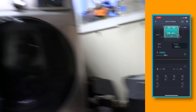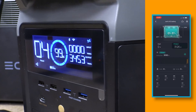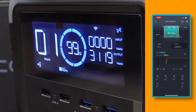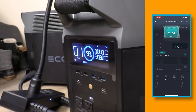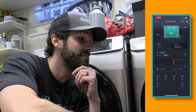How about an electric dryer? Boom — 800 watts, then it kicked into high gear: 3,000 running watts on both batteries. The heat element is cooking in that dryer. The fans have kicked to a higher speed. We're down to one hour of run time. But this is the heaviest residential load, right up there with air conditioning, electric cooking — ovens and cooktops. I'm quite pleased.